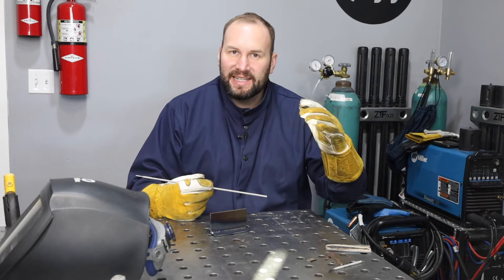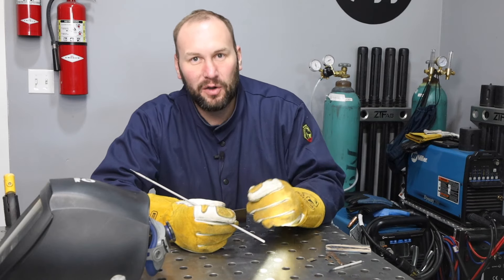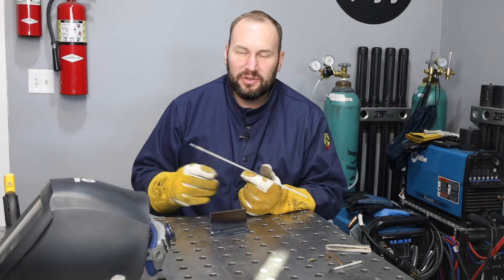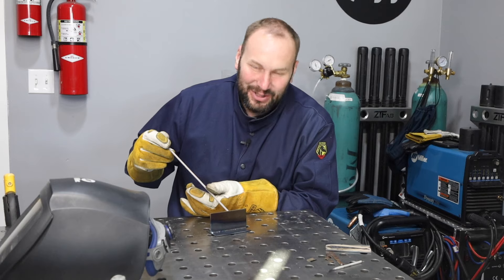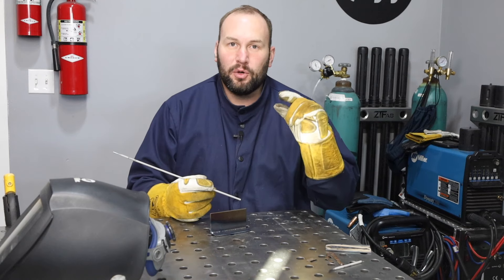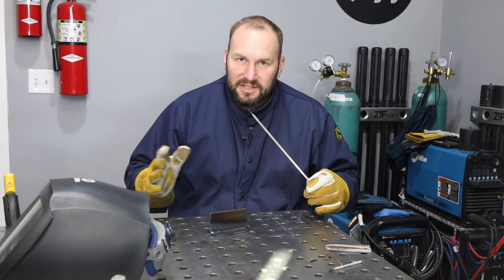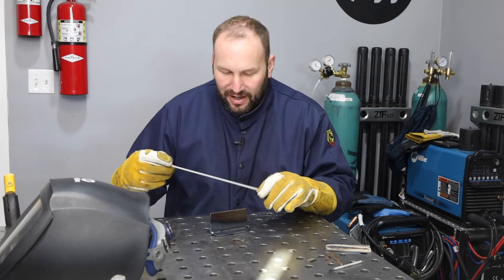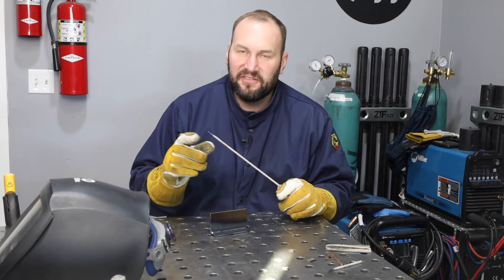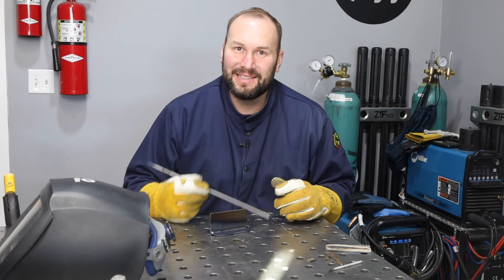When it comes to travel speed, this is where you really need to learn to see your weld — watch what's going on with the molten metal, not with the slag following over, but the actual weld pool itself. Your travel speed controls the size of your weld. If you're traveling more slowly, there's more time at each point to deposit filler metal and give you a larger weld; traveling quickly gives you a smaller weld. On the fast end, if you travel too quickly you'll often melt out more space than the filler metal has time to fill in, and you end up with a little recess right next to the weld — that's called undercut, and it can be problematic.